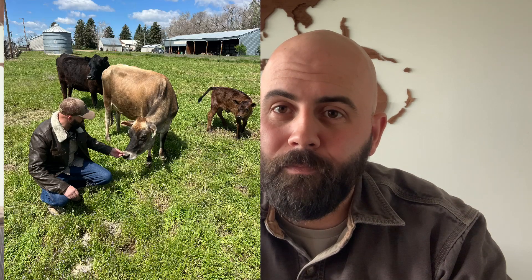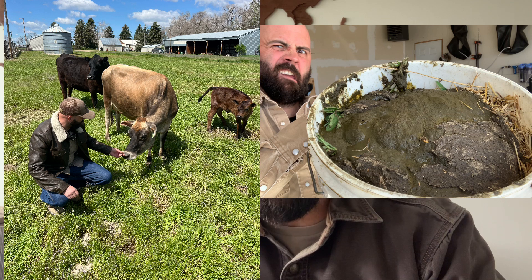Since I've got a 30-gallon barrel, I'm going to need 10 gallons of manure. I got two five-gallon buckets and went and filled them up with manure from a cow. Next, open up both valves on the digester and pour it all through the funnel. If you have a vessel where you can take the whole lid off, that would be ideal — you could dump the entire volume of manure in, fill it up with water, and mix it with a stick. I can't do that, so I mixed it up outside the vessel and poured it into the funnel. I used a paint mixer on a drill to help with that.